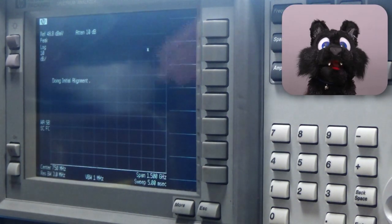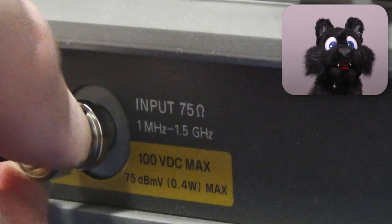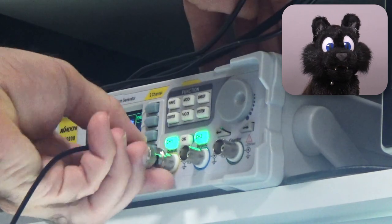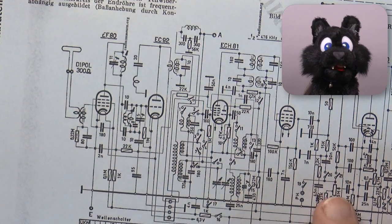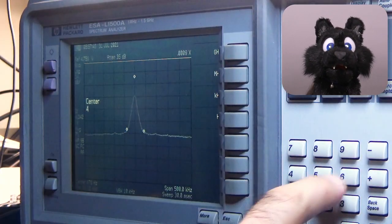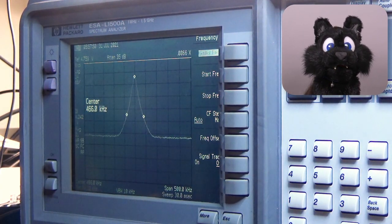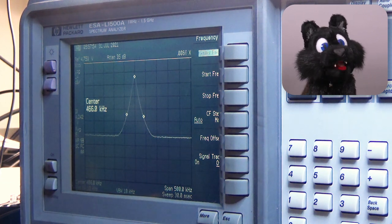Now for some quick testing. The L1500 model also has an official frequency range of 1 MHz to 1.5 GHz. Darn, I really wanted to use this to do some IF alignment on radios, come time to do that. A quick test reveals that this limit seems to be related to accuracy and not to possible range though. Nice! I only need peak detection anyway, so I'm good.